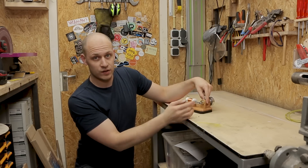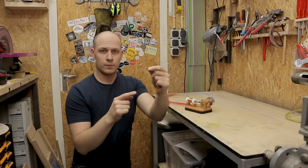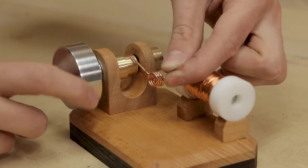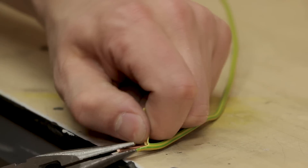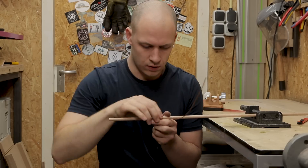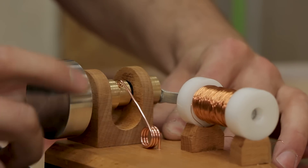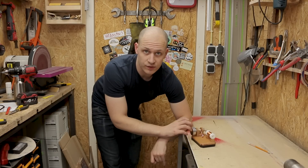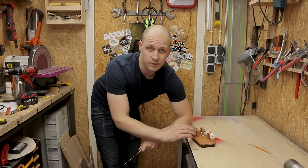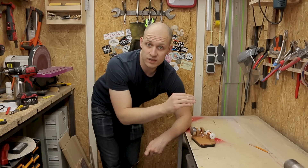On the far part it doesn't make contact and on the thicker part it does make contact. I've tried some things with copper wire and I'm going to make a little spring like this that I can put on the bushing. This one seems to work very well — it stays in contact at all times and it doesn't give too much friction, so that's really nice. The other one I want to have a little bit adjustable so I'm going to put it a little bit further away so I can have a fine adjustment of when it touches and when it doesn't.